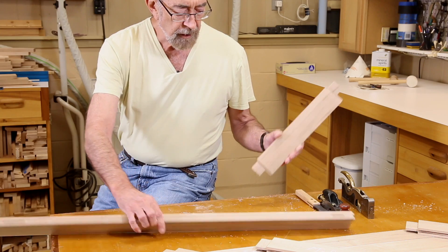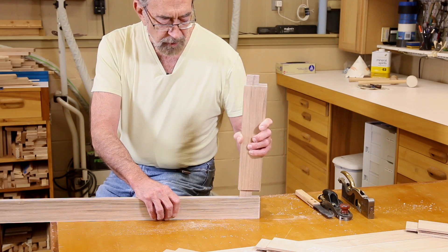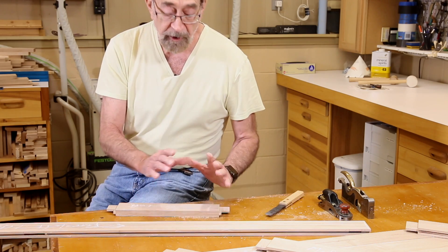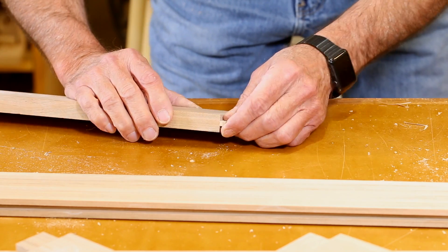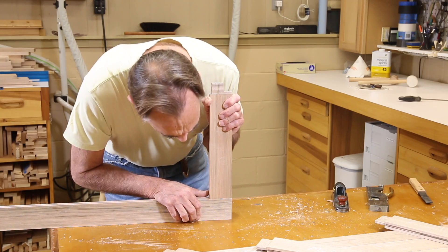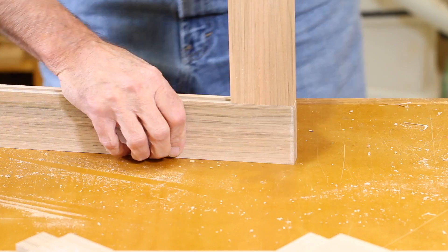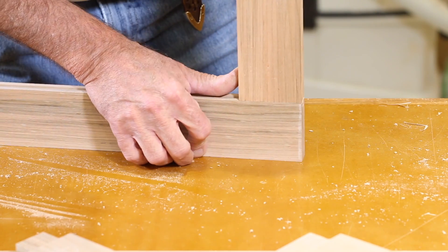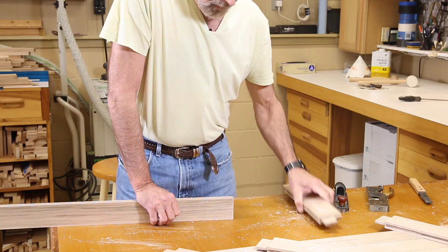So the way I'm going to fit these in is using a combination: I'm going to start with the skew block plane because it covers the whole width of the tenon, and then I'm going to touch up with the bed float. We'll get all these fitted into place and we'll be ready to go. Let's take a look and see how this fits. I want to see no seam, and obviously we want both sides to be flush to the style. Looking good — I think that's going to be the trick. I'm just going to keep working on these until I get them all done.